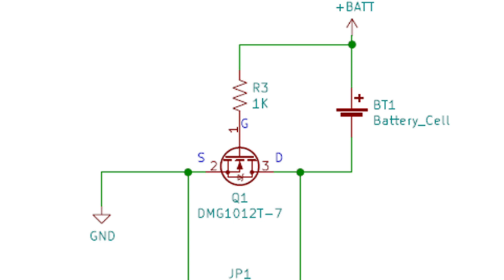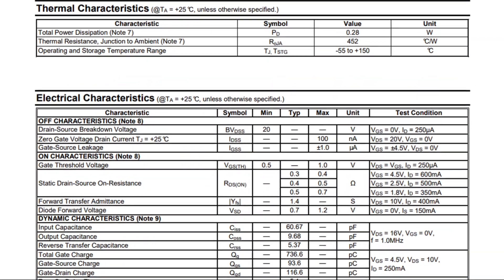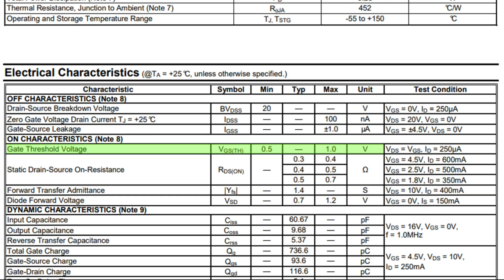The way this circuit works is pretty simple — I'll skip the details of how the current first starts flowing through the body diode of the MOSFET then the MOSFET turns on, but in very simple terms you basically need to know that when you have a positive voltage on the gate the MOSFET will turn on and start conducting. One of the important parameters you need here is the VGS, the gate-to-source threshold voltage, which needs to be as low as possible to ensure the MOSFET will open at low voltages. There are MOSFETs that open perfectly fine at VGS of 1.8V, and you might also want to look at the current and power rating to make sure you're not exceeding those, but it should be pretty easy to find an N-channel MOSFET that meets the criteria.